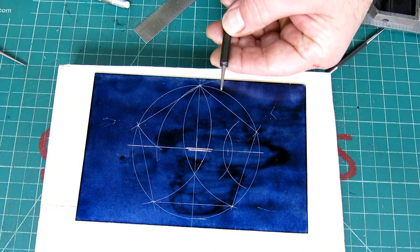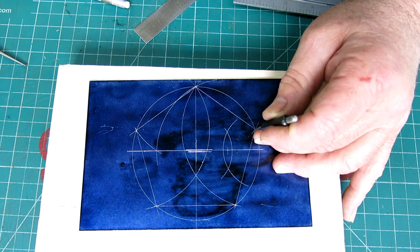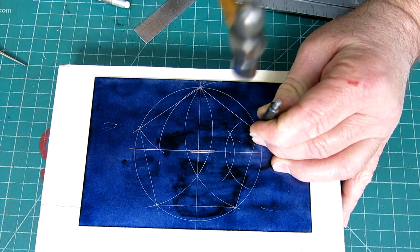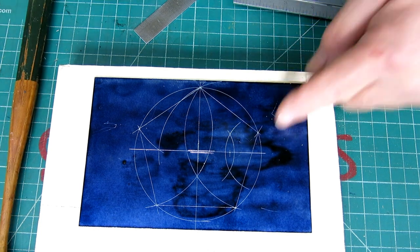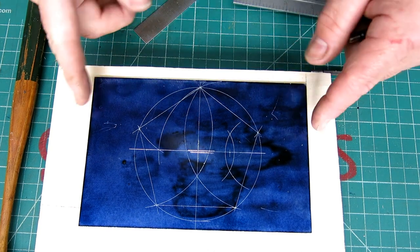And so now if this was a flange that we were going to poke holes in or whatever, then we'd come back with our center punch, which can drop into the prick punch mark nicely, okay? And then we give that a little bit of English there, a little harder, and now a drill point or the tip of a punch or whatever will go in there. I mean, a sheet metal punch or something like that.